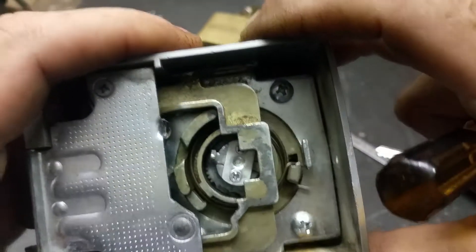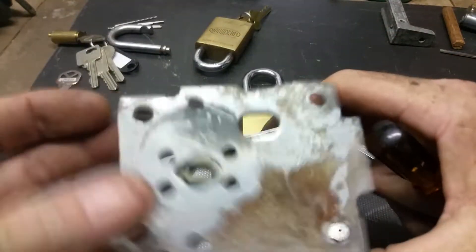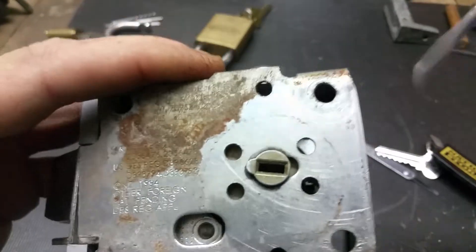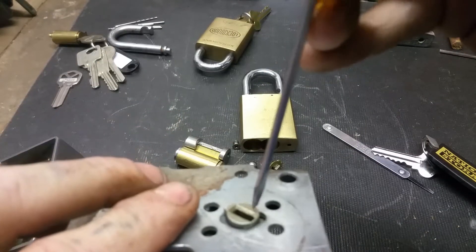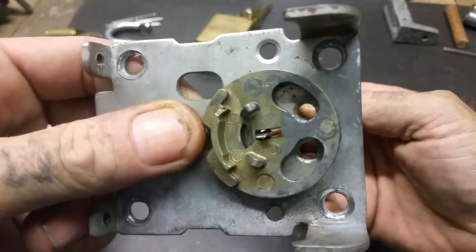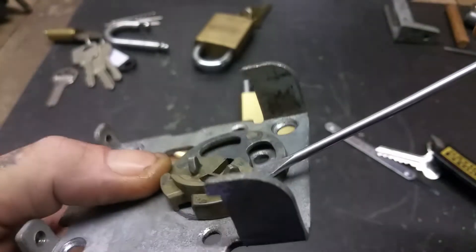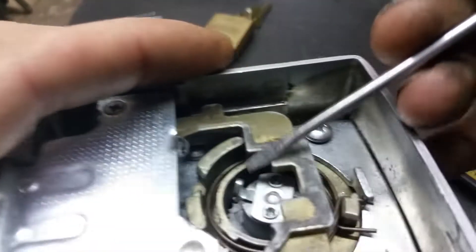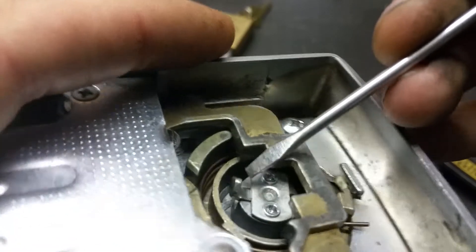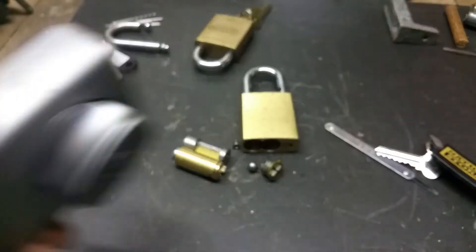So if someone does get in the house, they're not going out through that door. But when you come home, the cylinder spindle goes through there, and when you turn your key to open your door - depending which direction you turn your key - either one of these little nodules on the ring would rotate over that little diamond head part, and when it does that it automatically releases the hub, so that would go to green and it's free-turning straight away.